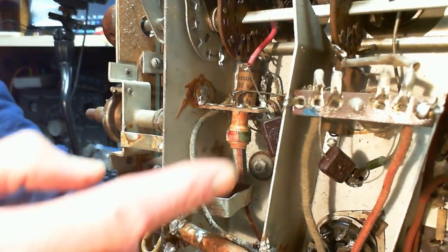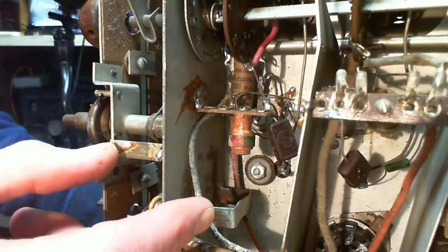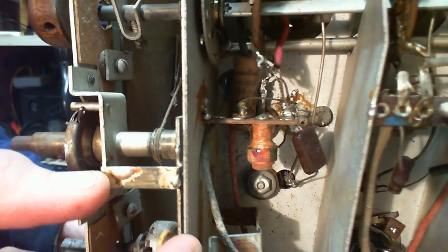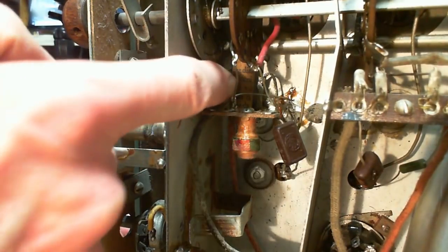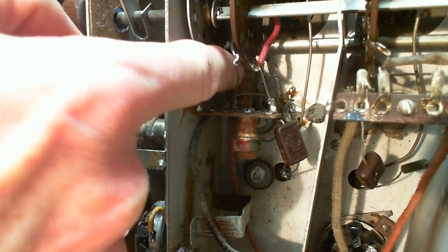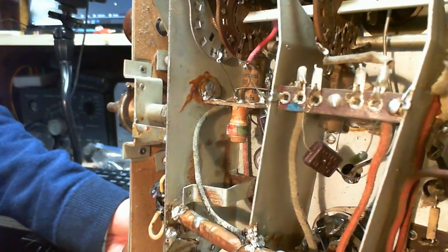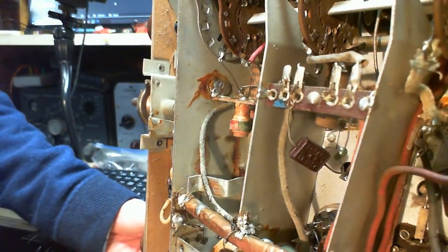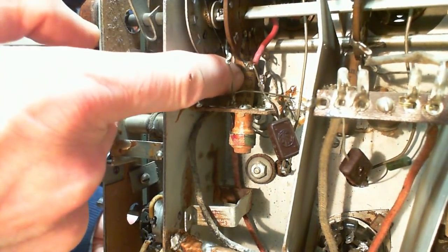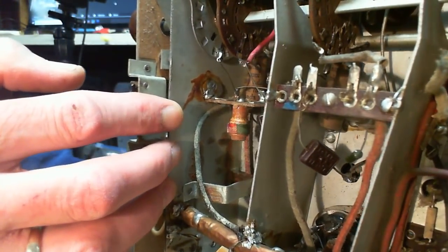So these capacitors I'm inclined to leave alone. I've always found them to be good. I don't know if I've ever found a bad one. You see the Canadian Marconi capacitor way in the back there. Now, these capacitors that are hidden way in the back, down under and behind, hard to get at, sometimes when guys come through and do the capacitor replacement job on a radio like this, they leave those ones. I've done that. I've left capacitors that appeared to be okay but were really hard to get at, and I just left them. Well, that one says Marconi.